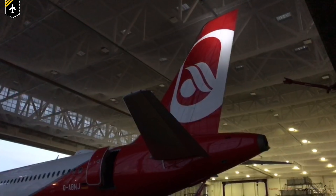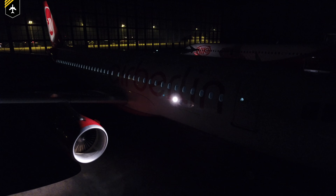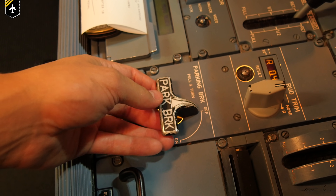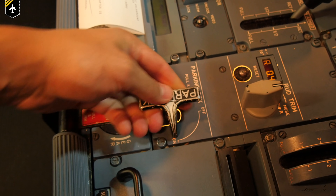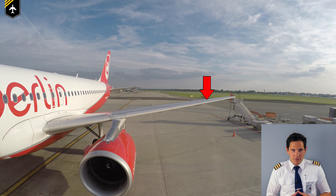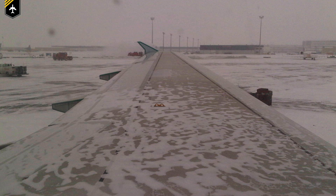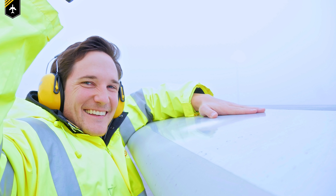Do not use your mobile phone — that light is a complete joke. It's also quite helpful to turn on the wing light and logo light to check for any contamination on those surfaces. Before you set off, set the parking brake in order to check the brake wear indicators on the main landing gear. As you step out onto the jetway staircase, you can quickly spot if there's any snow resting on the wings' upper surface, so you immediately want to inform airport authorities to sign you up for de-icing.